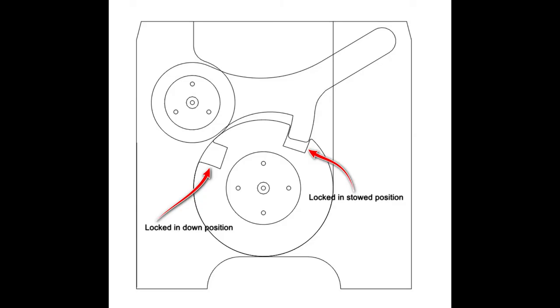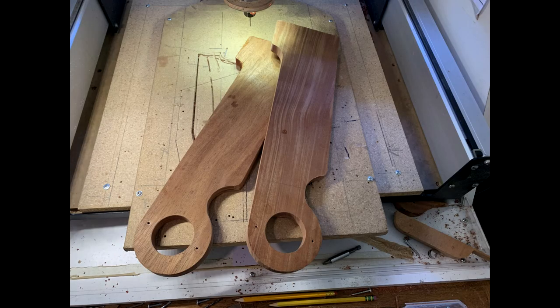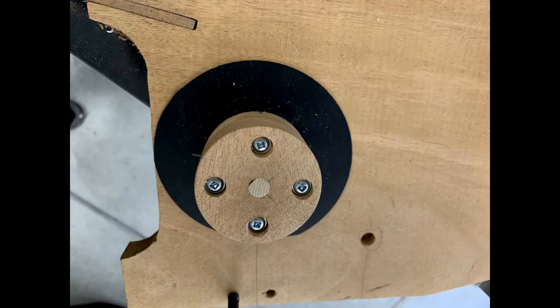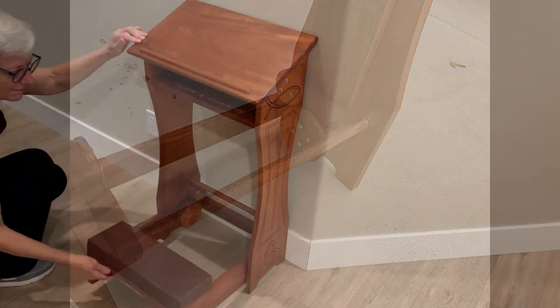Now on to how I designed the locking mechanism for the retractable kneeling pad. Here's the CNC drawing for the locking mechanism and what it actually looks like. Here are the legs for the kneeling pad and the parts for one side of the locking mechanism. I cut the sides from a plastic waste basket and made bushings using the CNC router — they create a good bushing surface and stand moving parts off of one another. I also lubricated all moving parts with beeswax. A mahogany dowel interconnects both sides to make the unlocking and locking operation a one-handed effort.